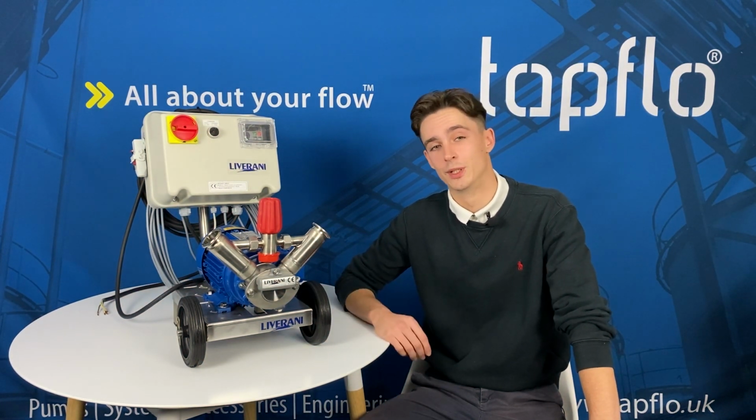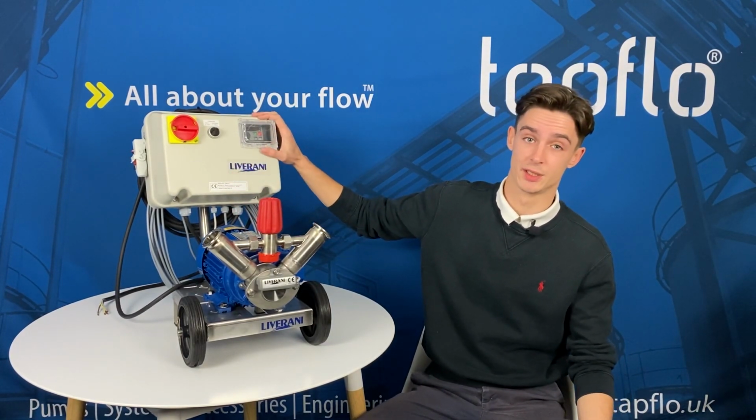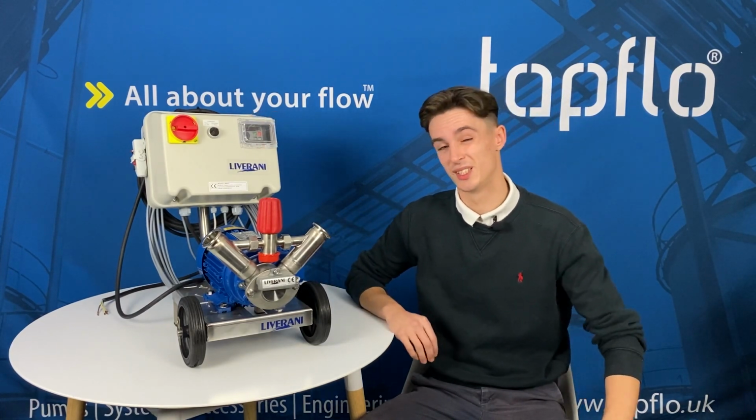So this pump is being used in an FDA application. We can supply them with a range of different FDA impellers and mechanical seals, and this one in particular is being used to transfer yeast from an IBC to a filling line, hence why we've got the bypass as well as the VSD. It's rated up to 60 litres a minute and can discharge at about 4 bar, but this particular duty is 1 bar at 60 litres a minute. The stainless steel trolley has 2 little wheels, but can also be modified to have 4 wheels depending on the kind of mobility you want.